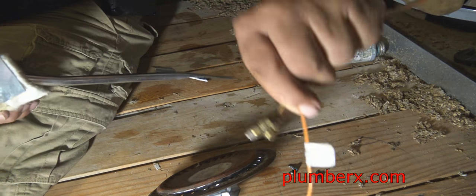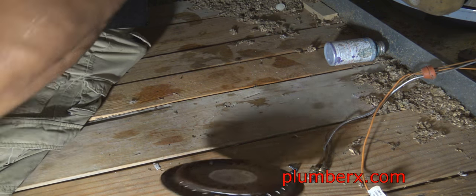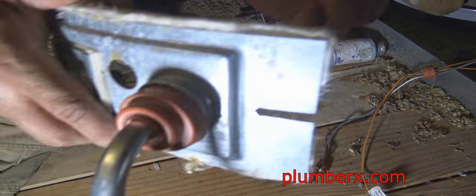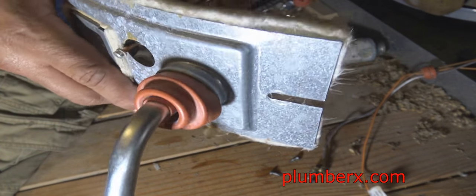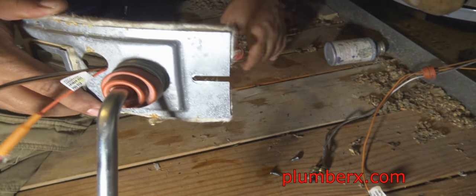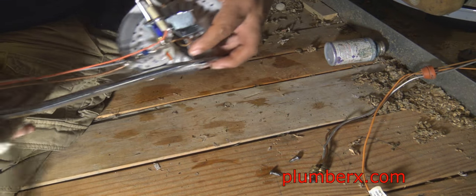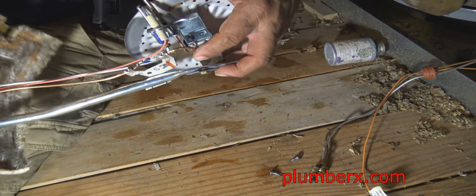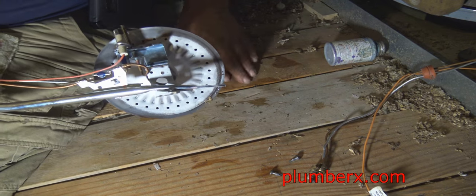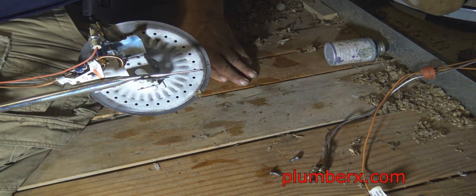And they do recommend that you flush your water heater once a year. Me personally, I think if you don't do it once a year, you're asking for trouble, because if you start doing it 3-4 years down the line and you cut it on, you may have issues with the calcium buildup. So as soon as you get the water heater, you want to start that yearly process.